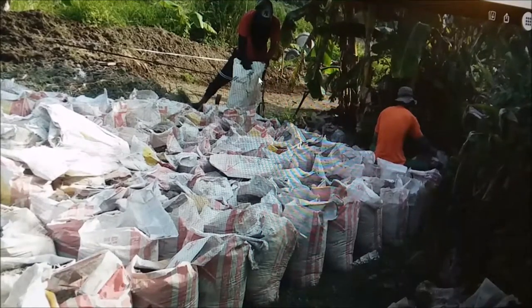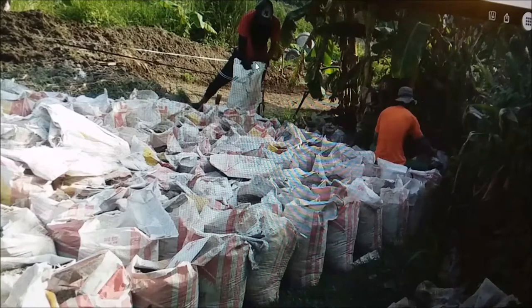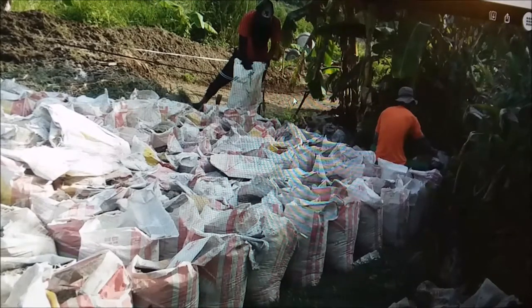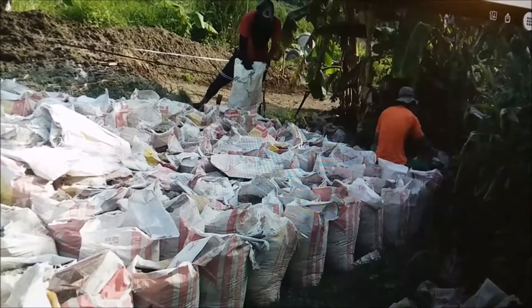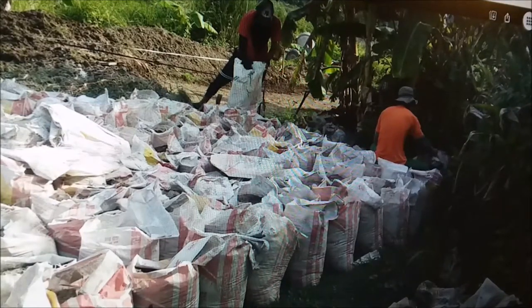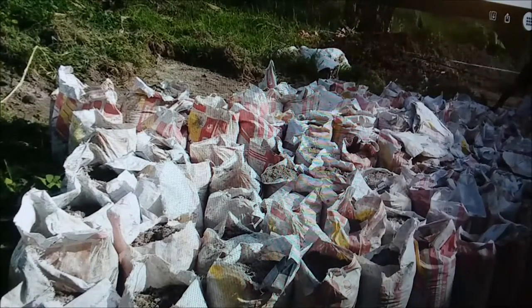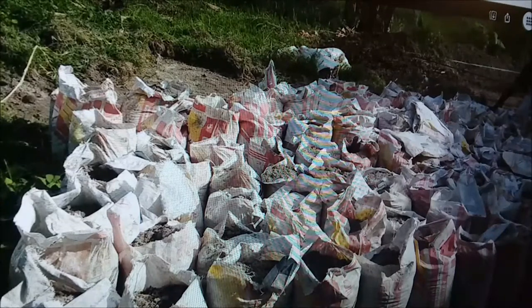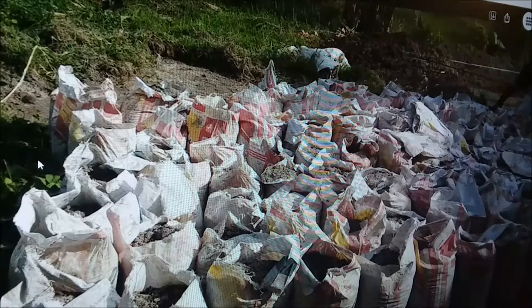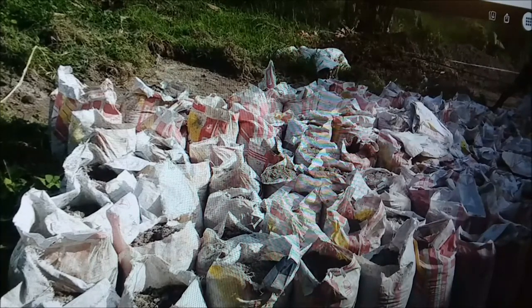That's Benji and Penn Hale — they're moving stuff down in preparation for pouring this floor. The mixer is over there but they may move it closer to the bags. One, two, three, four, five — two sand and three rock, row after row. They'll put the mixer six to eight feet from the ends of the bags, and once they've used up about five feet of bags they'll roll the mixer ahead. We cycle it pretty fast — we don't use a dump box, and we need three minutes of run time to blend the mix. They tilt the mixer and dump into buckets.